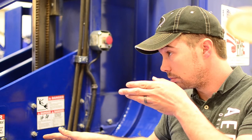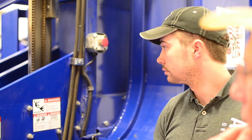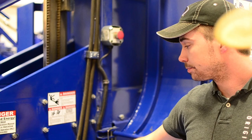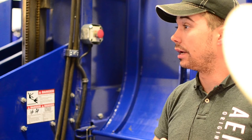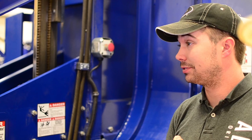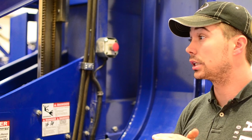You can do all that with the iPad, but you still want to know how to manually do it — because in deep tech support I want you to understand how the machine works fundamentally. When you look at that manifold I want you to understand that the coils show you direction. They're not always in-on-the-front and out-on-the-back. We have fail safes so that if you lose electricity, components go to the safest position. The safety valve that shuts everything off — its normal state is in the closed position.